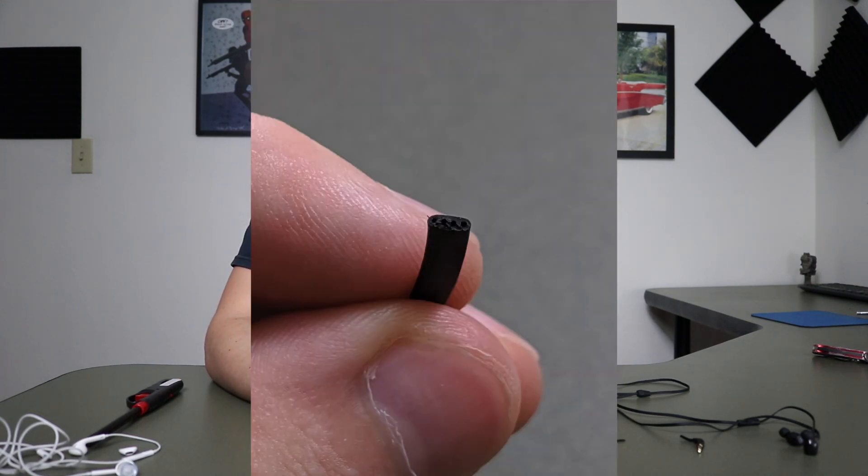I have already cut off the end of my headphones. These headphones work — one side doesn't work as well as the other, but it still works. I'm gonna take this apart. Pretty easy — cut it. The cool thing is you can actually see in here there are four holes and through those four holes are four wires. That's a very simple design. The two headphones up here, your left and your right — one set has two wires, the other set has two wires: positive, negative, positive, negative. They run to the end.